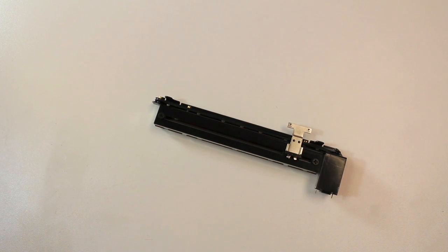Here we've got an interesting little product that Pete has alluded to in his According to Pete. This is something he found and is going to use in his audio project. This is a slide potentiometer — it's linear, 10K, but it's motorized. It's got a motor at the end so the slide can be motorized; you can send it one way or go back. Since the potentiometer has two taps on it, you can monitor where the slider is across the whole range, and then you can use that reading for a feedback loop and the other to read into your microcontroller.